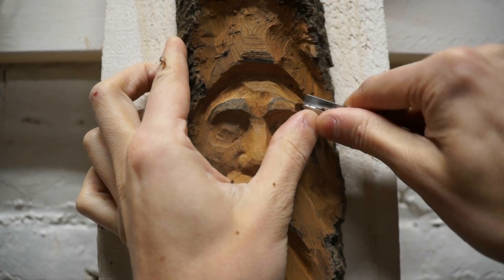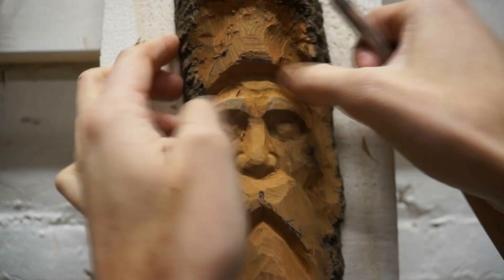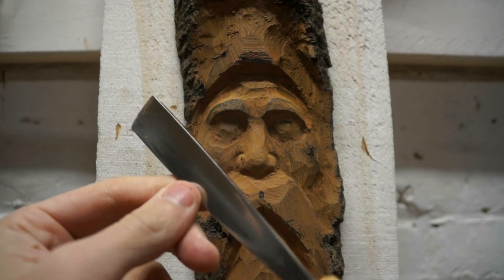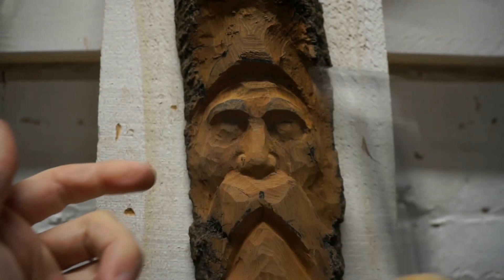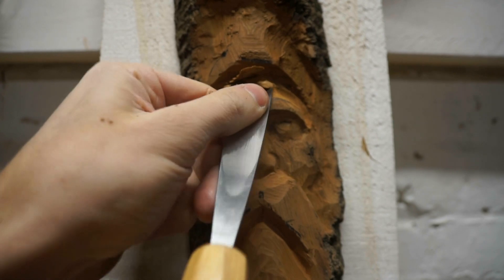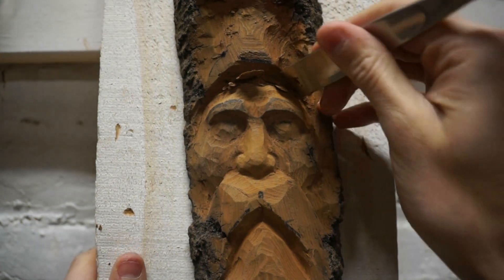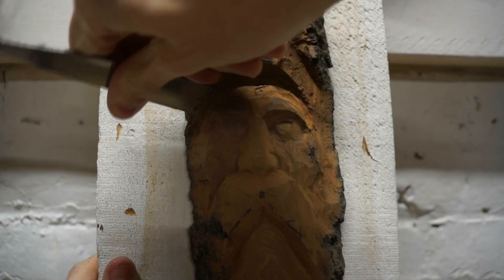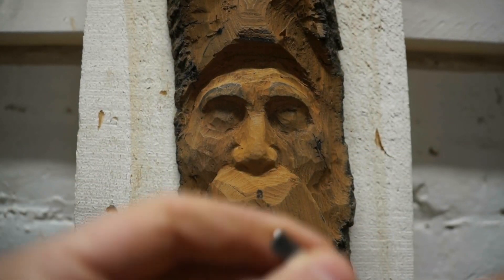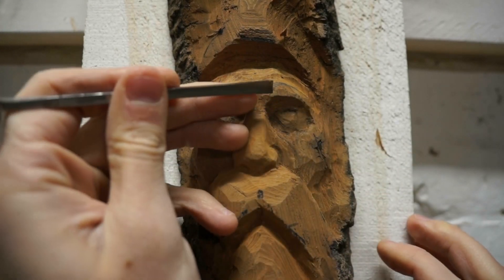Following this pencil line for the eyebrow, we're just removing the material on the surrounding areas of the forehead. We're also going to use a flat gouge — the number 3 — to level out the rest of the forehead and smooth things out. Next we want to eliminate the hard lines, rounding off with this number 3 fishtail gouge, removing a very, very small amount of material.